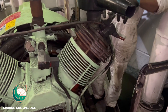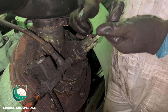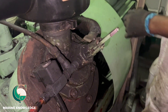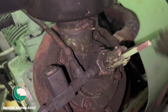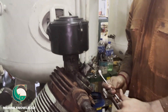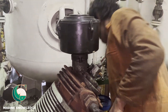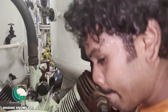This compressor is an auxiliary air compressor or service air compressor where we are planning to do the major maintenance. Always do the safety precautions before you start the job. For this compressor you have to close the outlet valve, switch out the power, hang a 'do not start' tag, and put the compressor in manual.